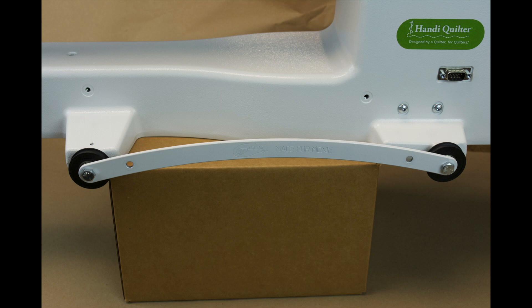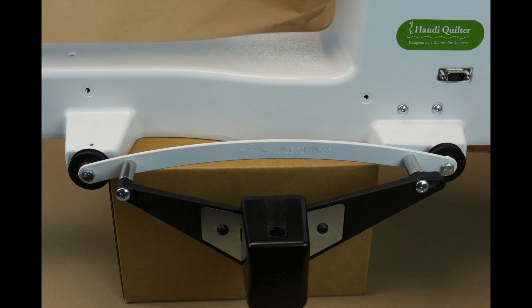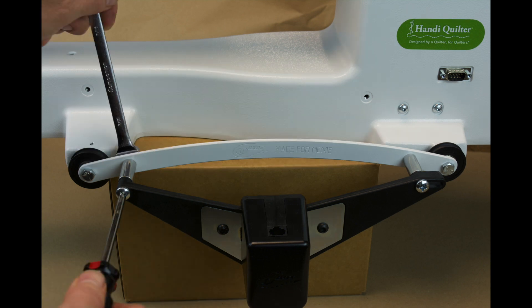Now we are ready to mount the Y-axis drive assembly. The drive assembly hangs below the bottom of the sewing machine, so you can do this step by either placing the machine near the edge of a table, or placing the carriage back on the Loft frame and placing the machine back on the carriage — I recommend placing the machine back on the carriage on the frame for safety. With the other drive assembly in hand, place a 1/4-20 x 2-1/4-inch screw through the drive assembly as shown, then slide on a 1-1/8-inch aluminum spacer. The drive assembly then attaches to the bracket as shown; secure with two 1/4-20 nuts.